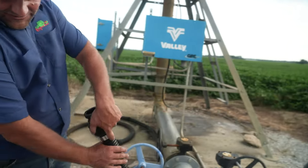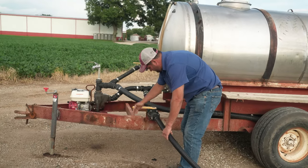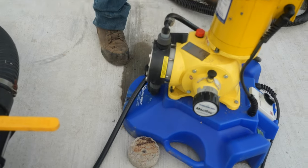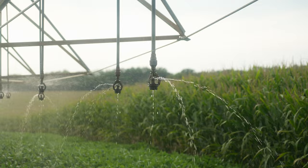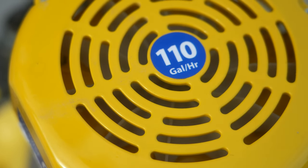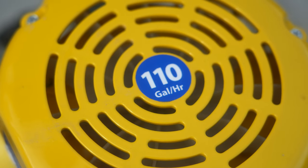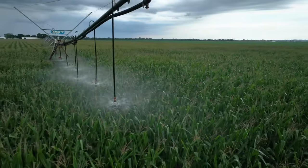This is our miracle grow. We need a miracle to get good corn out here. We just hook this up to the tank, turn it on. This is our supply line to the pump. These are Agri-Inject pumps which are, in my opinion, the best you can get. You can control the speed and this is 110 gallon an hour wide open. We're putting 110 gallon an hour on, injected through a smaller three-quarter inch line into the water.